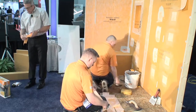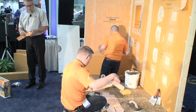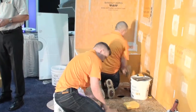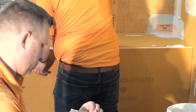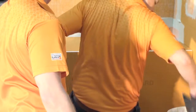We make the tail on each side of this longer than 2 inches. And remember, we only require a 2-inch overlap. The benefit of that is when we bring the Kerdi band in on these two sides, they don't have to overlap themselves back in this inside corner. They can simply terminate out here as soon as they hit 2 inches over the top of this, which means we don't end up with 3 layers back in here, because that's going to build up. And a lot of time what you're going to put on these things, if it's on a shower pan, is a small mosaic. So he's put that piece in.